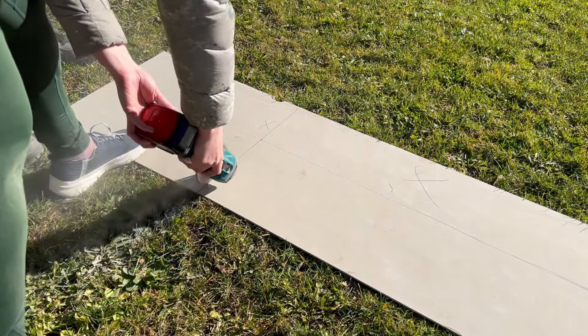Once the new hob around the bath was finished, I needed to go around and countersink and screw to reinforce all of the walls. Tiles are heavy, and when you think about how much weight is going to be attached to the wall once all of the tiles are on — that is a lot of weight for these walls to hold. I'm also going to be tiling all the way to the ceiling, which means even more pressure and weight. So I went around the whole bathroom, marked out where all of the studs are, countersunk holes, and then added screws about every 10 to 20 centimeters apart, all the way to the ceiling.